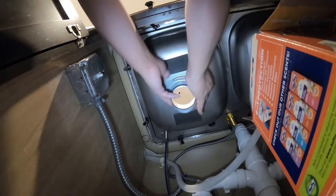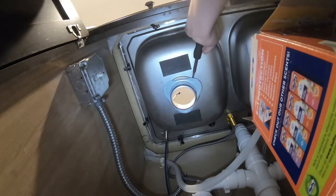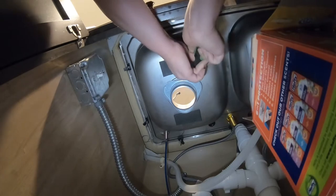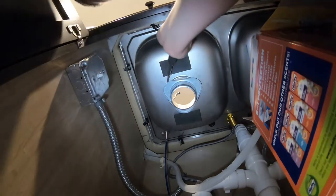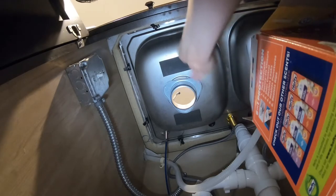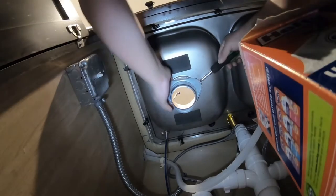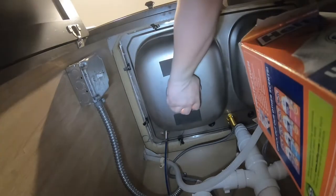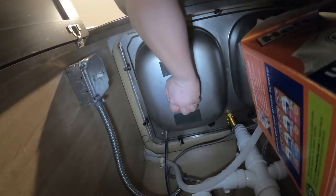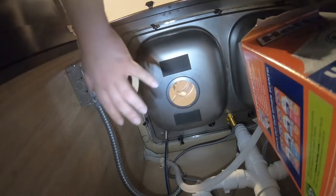This other metal piece normally comes right off, but someone used silicone instead of putty, which is why it's really stuck and giving me a hard time removing it from the old drain metal attachment. I'm going to fast-forward this part of the video, but I decided to leave it in because you might run into the same situation — where someone used silicone instead of plumbing putty and you have to wiggle it loose.